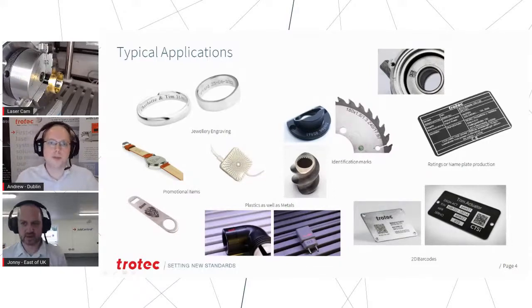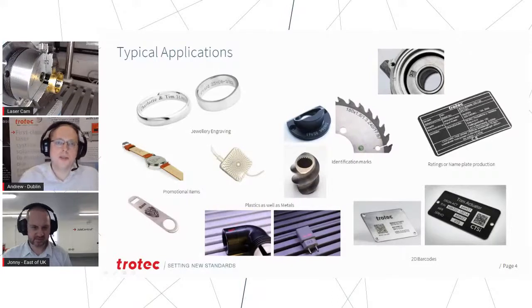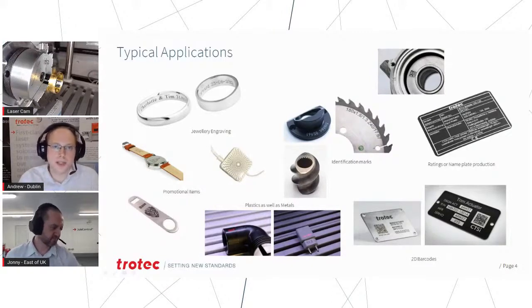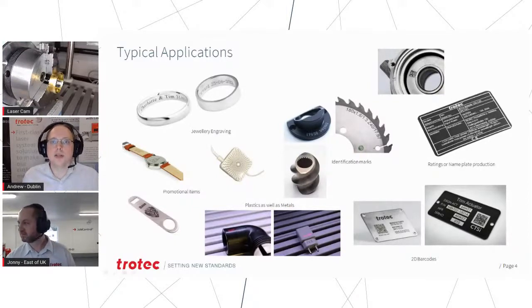When we go to more of the personalization and gift marking, again, something that maybe people might use a flatbed or a plotter for, but they're looking at a galvo for increased production speed, maybe increased usability as well, or one-off. So it really lends itself to small run bespoke items. And certainly if you've got a large marking area, the back of the watch, for example, it might be 10 times faster on the galvanometer machine than a plotter machine. So getting those jobs out quickly is paramount.